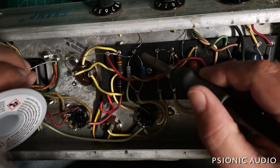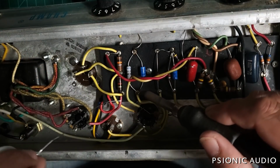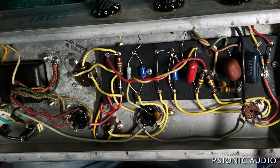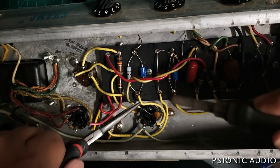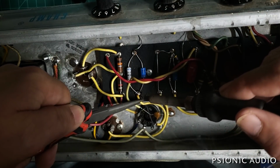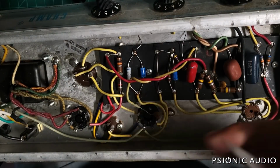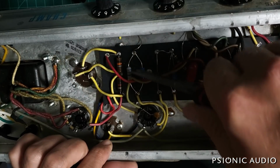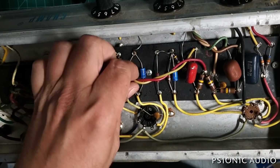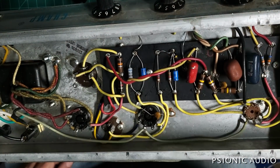A little bit more over here. Make sure it's really good in there. Damn it. It's only because I'm trying to film this. Okay, I'll clean that up later if this resistor makes the cut, which I expect it to. I'm going to get it a little bit up off the board, just in case anything should go wrong, while making sure it's got a physical distance to these wires, just in case the body of it gets hot.